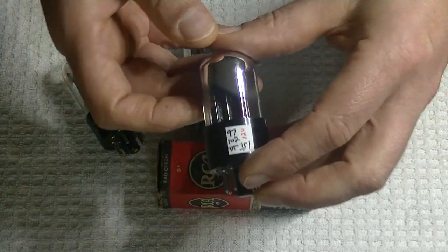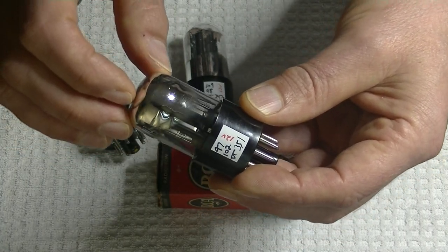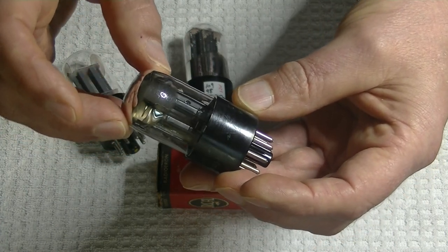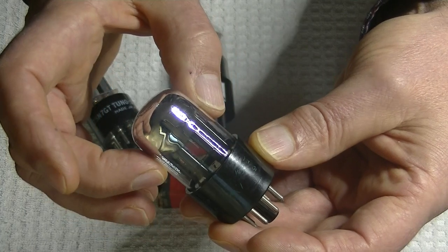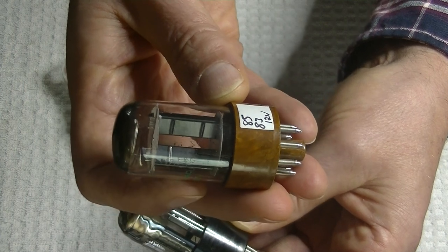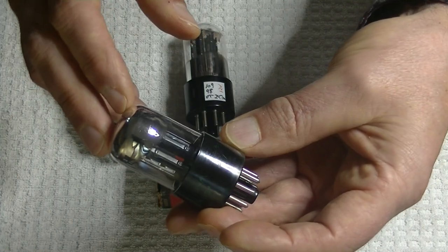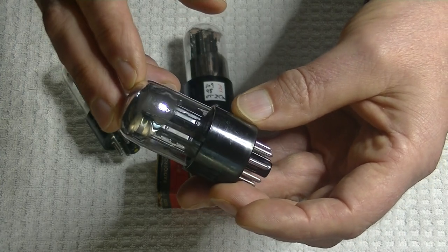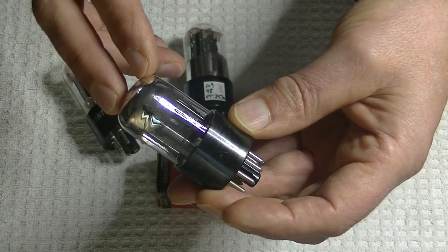This is one of my favorite modern Sylvania 6SN7s — the 12-volt version, the 12SN7 GTA Sylvania straight plate. You can see how these plates are just back-to-back. The more common version had angle plates, which came after these. The GTA has an angle plate version that's more common, so I suspect these straight plates were only made for about 6 months or a year. They are very rare and expensive — as soon as I get a matched pair in, they sell instantly.